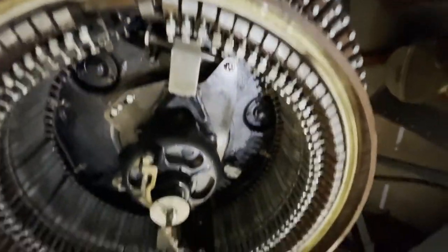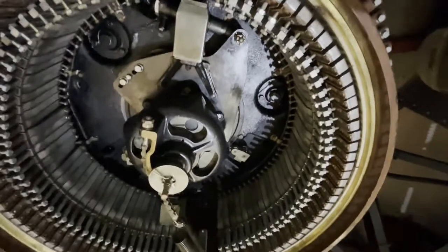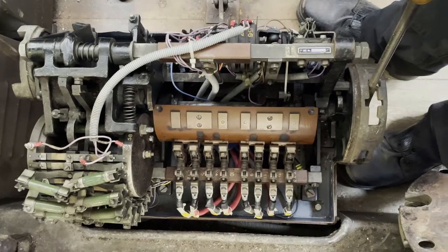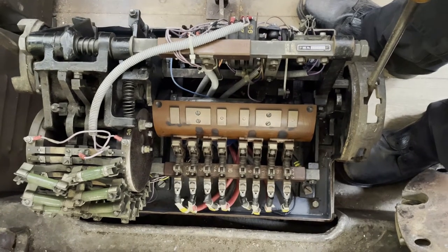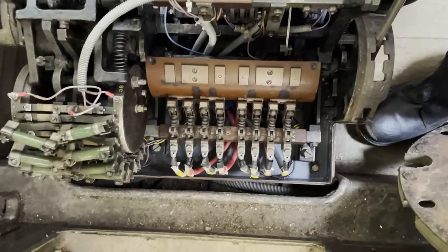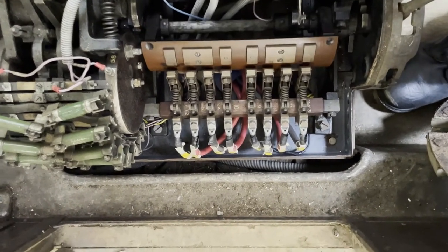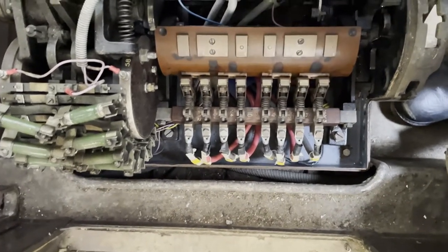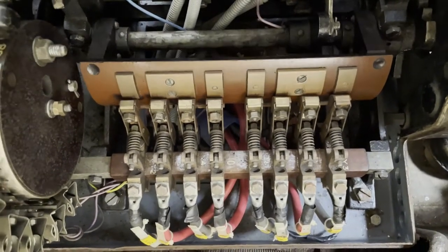Plus, it's a feedback system rather than being direct control. This is the controller in cab one with the cover removed. Part of it has big solid contacts, lever operated — very much like the forward and reverse in the traditional controller — with different sets of segments that come under the contact wipers depending on the forward and reverse settings.